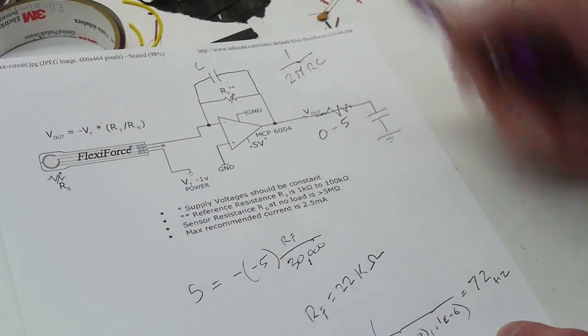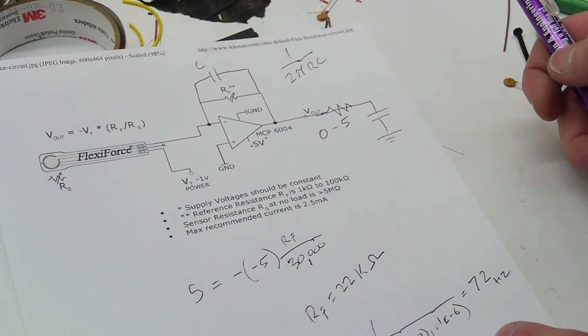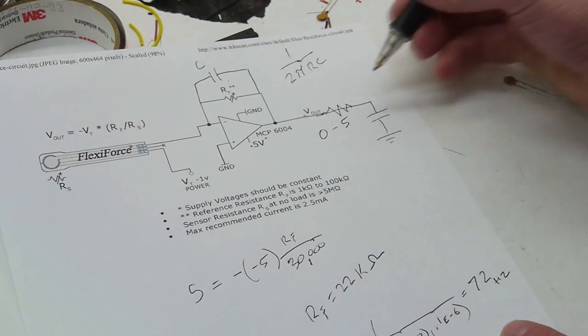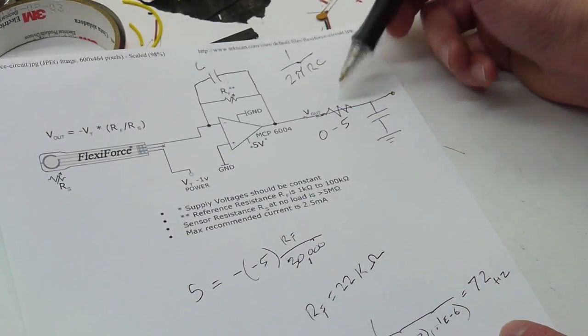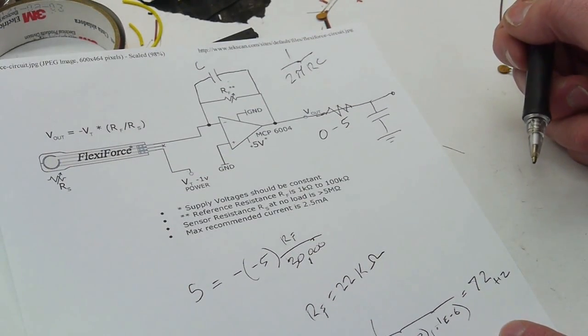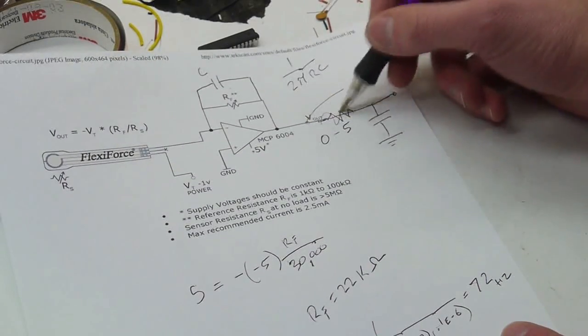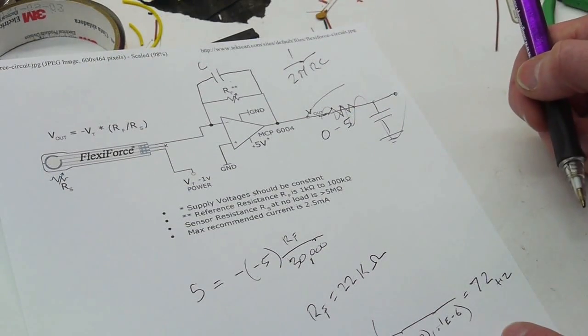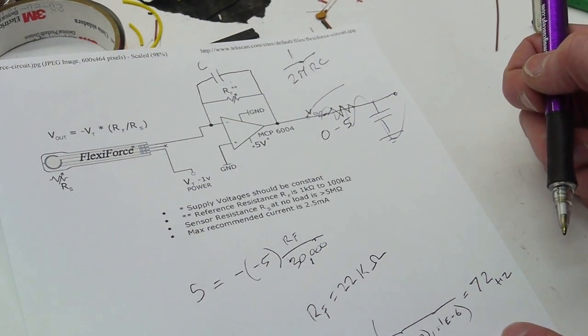If you add them together, I think then you have a 2-pole filter, and you can have them at the same cut frequency or even different cut frequencies. Then the only problem is your output impedance going this way is going to be affected by how big that resistor is. So in this case, I don't want to do this. I'm just going to take the output straight from the op-amp so that I have a fairly good output impedance and do all the filtering here or even before.